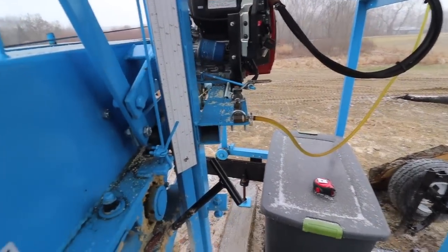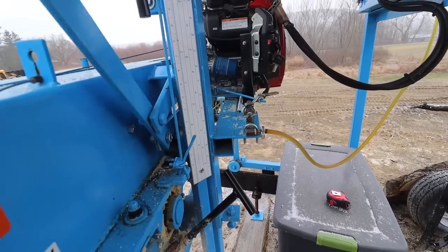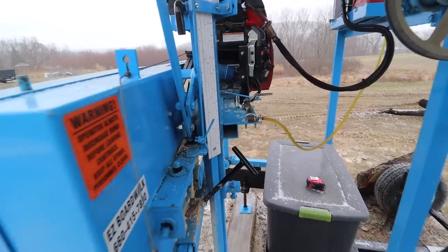Let's talk about other functionality. I thought Woodland Mills was one of the few sawmills that automatically turns on your lubricant whenever the blade is turning, but there's a very simple mechanical setup on this mill that does the same thing and isn't likely to fail. When you hit the lever to engage the engine and the blade, that lever is also tied to another lever which switches a valve on your blade lube loop — it opens that valve and allows blade lube to trickle onto the blade.